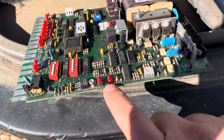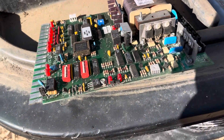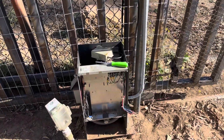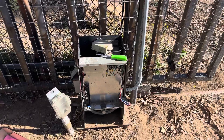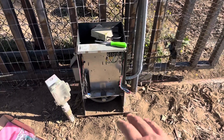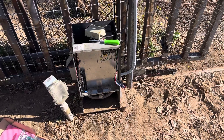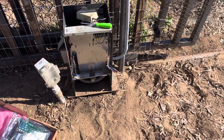These sensors are the ones that make the count as the gate passes through. There's a magnetic little spin wheel on this gear that constantly comes through and counts. If that area is dirty I've had problems where it's not properly counting, so keeping this area clean is important. In my situation with a lot of dirt, I have to make sure the cover is plugged up properly.